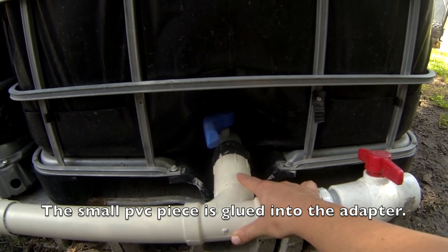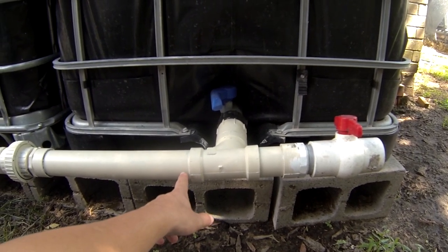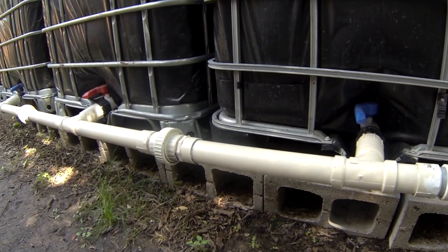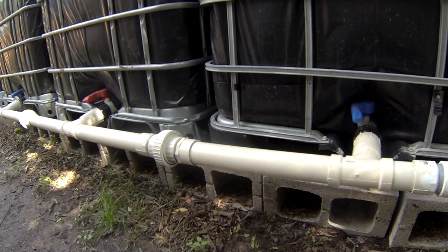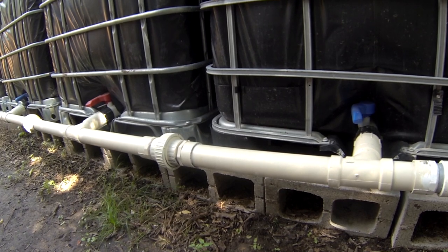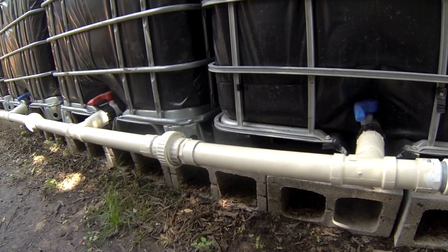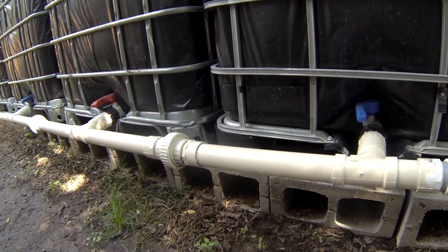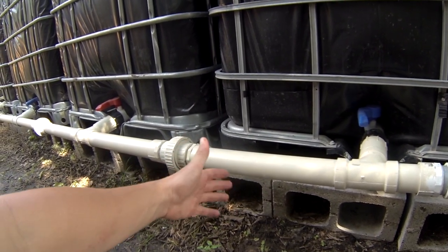From there I have about an 18-inch two-inch PVC piece that leads to a union. This is a threaded union, and connected to that union is a two-inch PVC — a female slip to a male threaded PVC piece. I use threaded in case I want to cut anything off or if I mess up anything or need to change anything. I don't want to mess up my union by inserting a slip where I glue it in, because then I don't have the ability to pull that piece out.